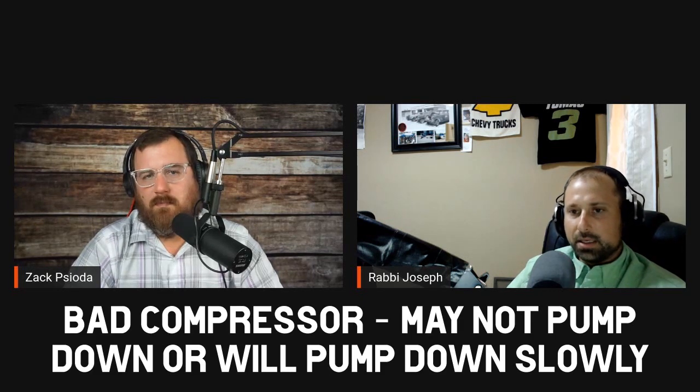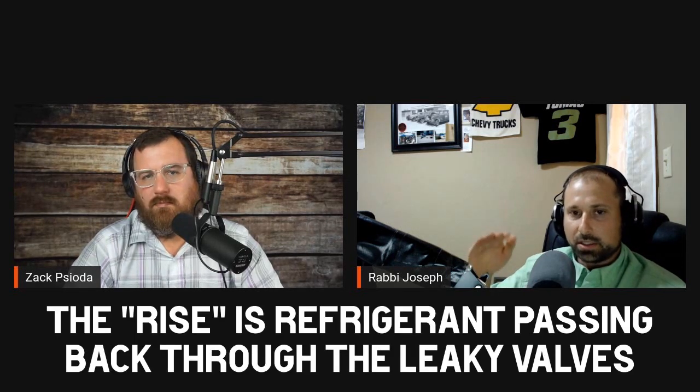What I'm looking for when I pump one down is that it hits about 30 PSI and just really seems to stall. It continues to drop, but very slowly — maybe 30 seconds to a minute and you're only down to 10 PSI. Then you shut the compressor down and watch it slowly rise. Some rise quick, others very slowly. Typically it's going to be the suction valve from liquid flooding, but discharge valves can get hammered too.